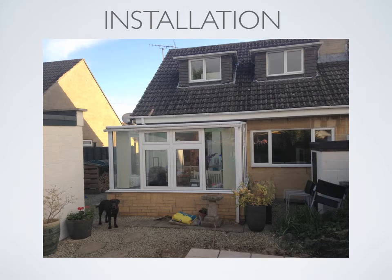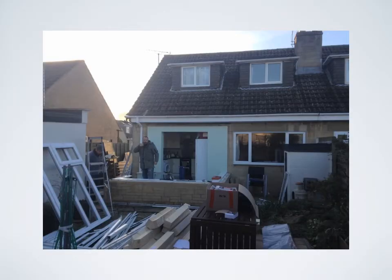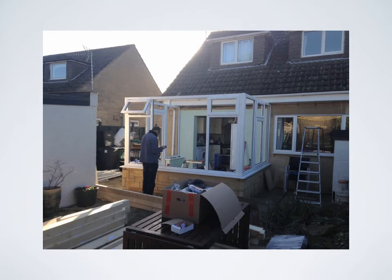The installation took place in November 2016, so please forgive the dull photography. To create more height we needed to change the roof design. In this conservatory both the frames and roof had to be replaced. It's worth pointing out that you do not have to replace the frames in every situation to install a solid tiled roof. As you can see, we have removed the old conservatory frames and roof down to the existing dwarf walls. The existing base is structurally sound with good depth footing, so we are able to rebuild using the existing base. The new UPVC frames have been erected to the underside of the house soffit — the height required to install the new solid tiled roof on this property.